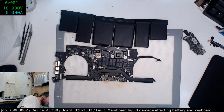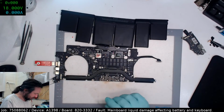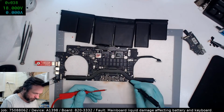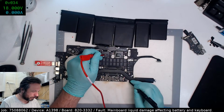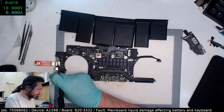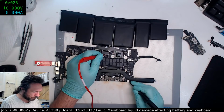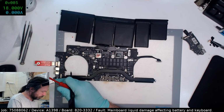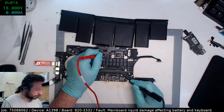Plugged in. And we just now want to see if that battery charge rate is picking up or not. Yeah, we got nothing. So it's like the battery isn't being told to switch on. Literally, the circuitry in this section here is not responding. And yet, funnily enough, we are retaining power. That's weird. What's going on here? You're confusing me. All of a sudden we do. Okay. As soon as I plug you in. And now you're good. What a son of a gun.